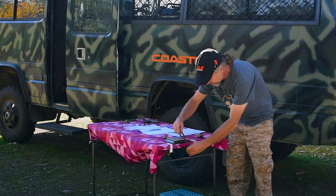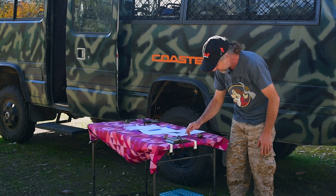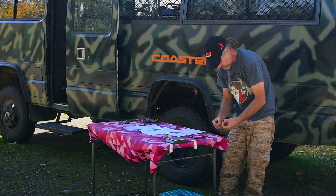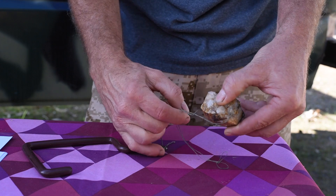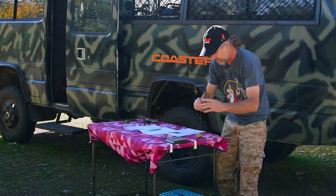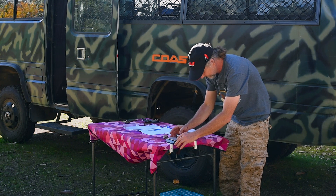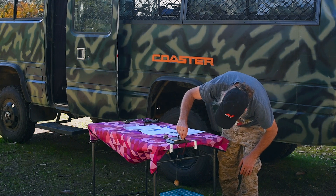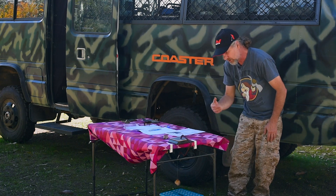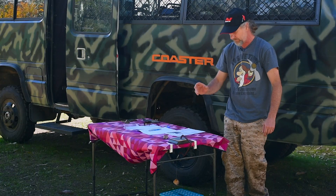So I'm going to remove the water and put this suspension mechanism here and zero that out so it goes to zero. Now I'm going to tie the gold specimen onto the fishing line and then suspend it off the scales again — if everything is going well we should get the same weight as previously. Bring it out a bit and make sure it's not jagging on anything. Sometimes it can be tricky to get exact. That's a hundred and nine point nine — we had a hundred and ten point one before, so point two of a gram, that's close enough.